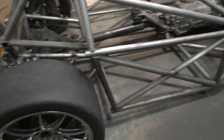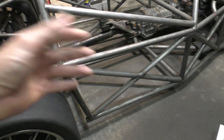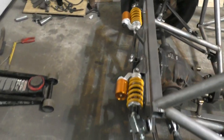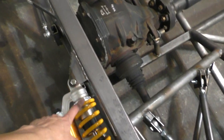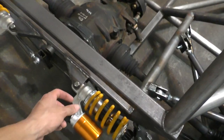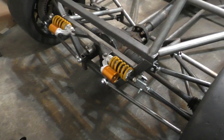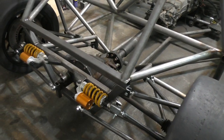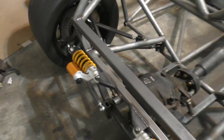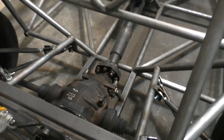The car is sitting at its perfect ride height both front and rear. Obviously the car will gain some weight when the seats and remaining components are installed, but right now the springs are under zero preload. At the final weight I think I'll need to add about one centimeter of preload on the spring to compensate for all the weight still to be added. The remaining work on this rear section is finishing the differential attachment points and adding some extra braces.